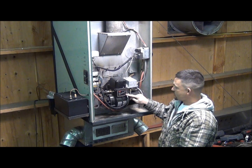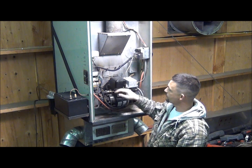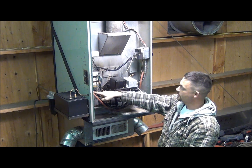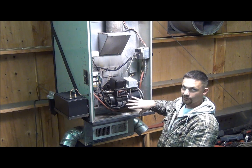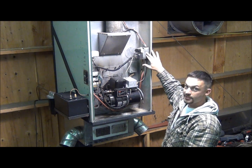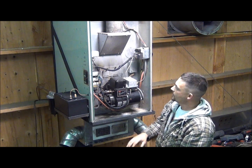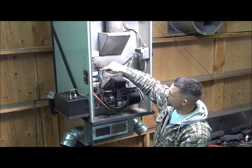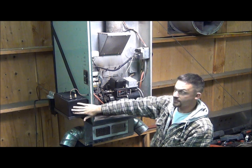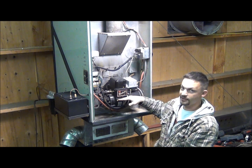What we have is a Beckett AF series burner right here, and really all I've done is change the nozzle block out in it. I have my air pressure regulator right here — right now it's set to about 17 PSI. I have my air pressure solenoid, which is actually what turns the air on and starts the air and oil flow through the nozzle. I have the factory Olsen transformer and relay, which applies power to my temperature controllers when the thermostat calls for heat. I have the two temperature controllers: the top one controls the temperature inside the nozzle on the burner, and the bottom one controls the temperature inside my siphon tank, which holds my oil at a constant level just below the center line of the burner nozzle.